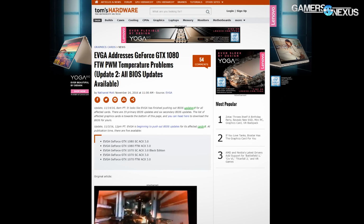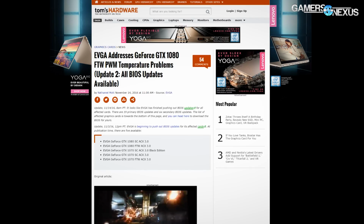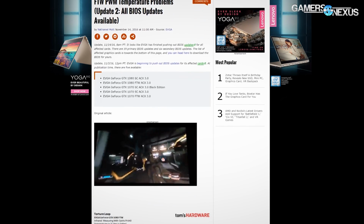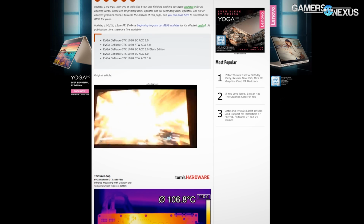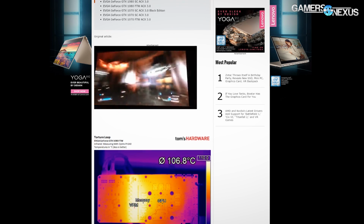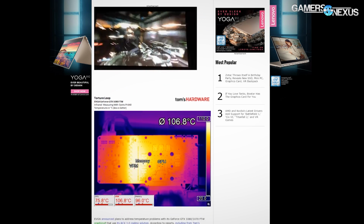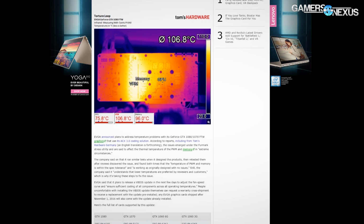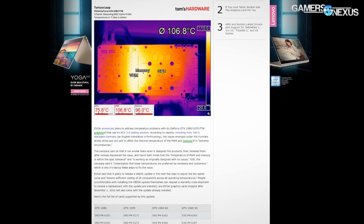Let's recap the basics again. We recently validated a Tom's Hardware test which suggested that EVGA ACX devices were heating up on the backside of the VRM to north of 100 Celsius. Note that VRMs, though, can handle 100 C no problem, but the temperatures that Tom's had shown, hitting 114 C in some reports and using thermal imaging, were beginning to enter the range of being concerning.